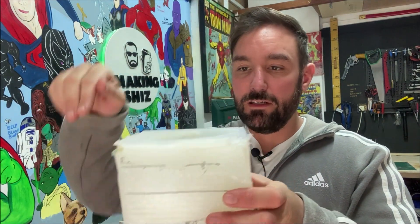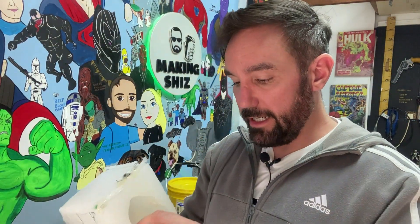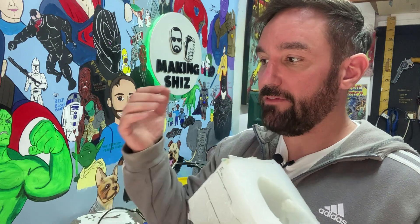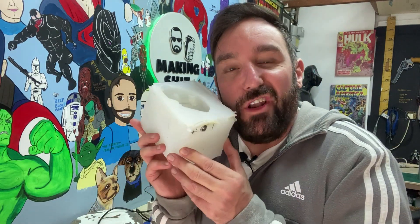So let's get some resin mixed up, put some in there, let it settle, then we're gonna heat gun it as much as possible. If you gently heat the resin it makes it watery and lets the air bubbles escape to the top and then you can burn them off. But if you're warming it up too much you're gonna get an exotherm, which is a speedy reaction of the chemicals that you don't want because it cures too quick. So it's just a gentle, gentle warm — see what it looks like.